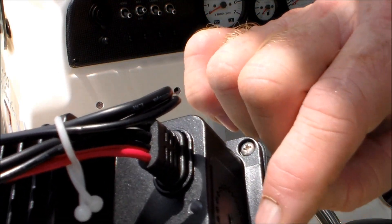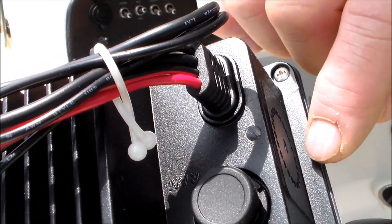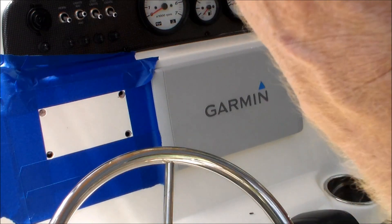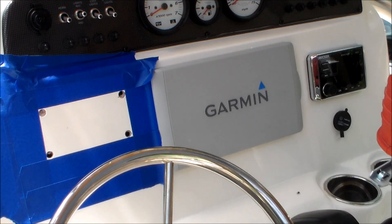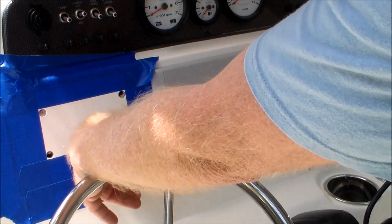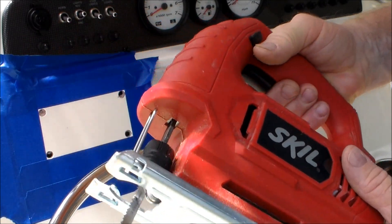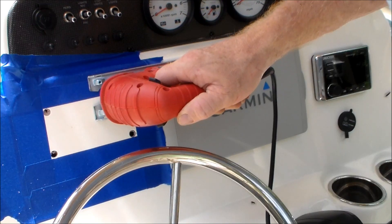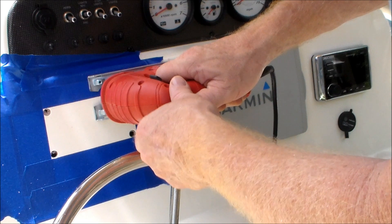If a chip goes beyond that quarter inch lip it's not going to cover up. I put tape all the way around and instead of drawing a line I used the tape edge from corner to corner — that's what I'm going to follow for my straight lines. I also put tape around there so the bottom of the jigsaw doesn't scratch the fiberglass or leave marks. You want to protect that as well as you can. All right, I've started the hole — we're going to do as much as we can with this and then might need a smaller tool to finish the cutout. Here it goes — hold your ears.